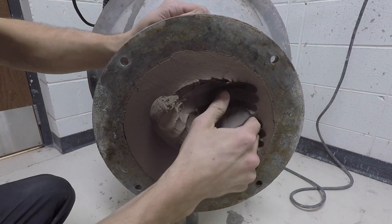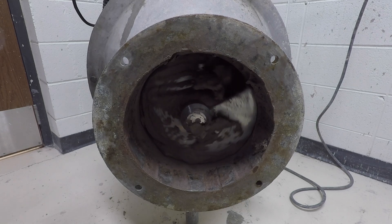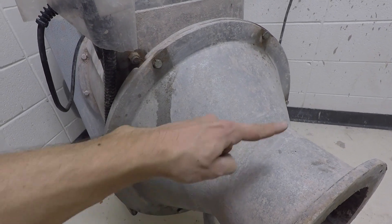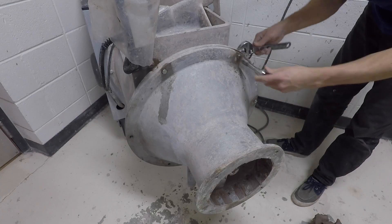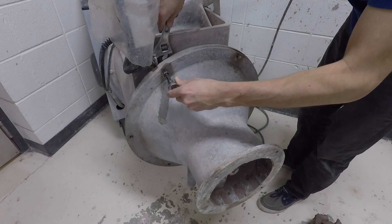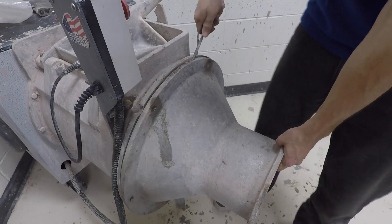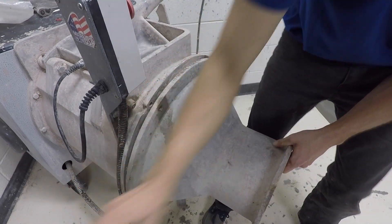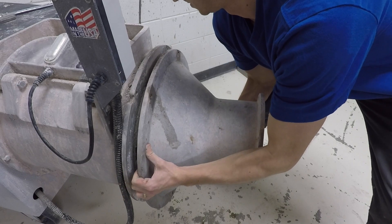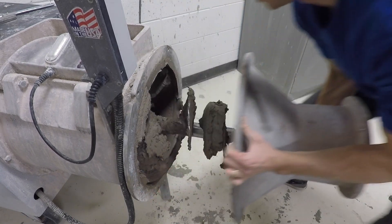Here's a little preview of the auger inside. Next, remove the other six bolts on the back half of the reduction nozzle, starting with the bottom first. I used a scraper and then a screwdriver to slowly and gently pry the nozzle away from the mixing chamber. When it starts to detach, slowly wiggle and pull the second half of the nozzle off. Be careful not to bend the auger.